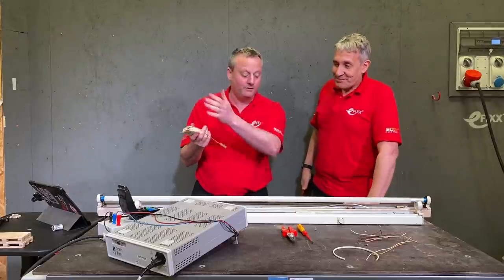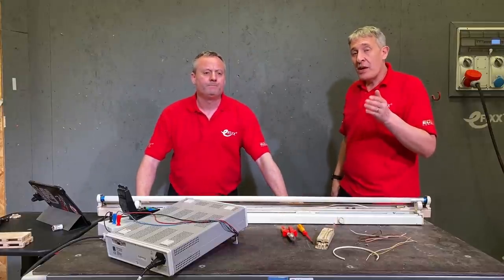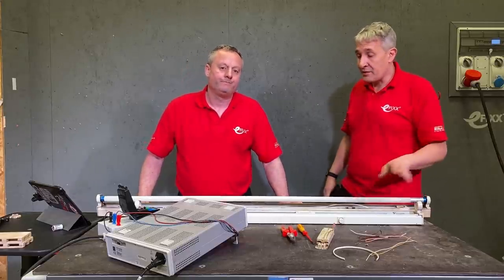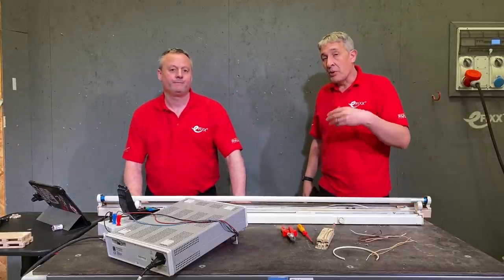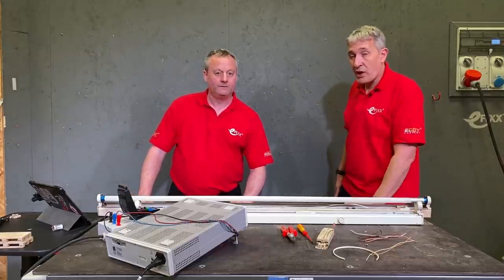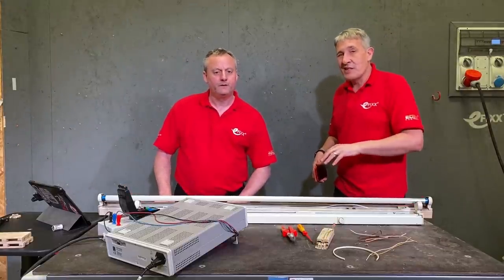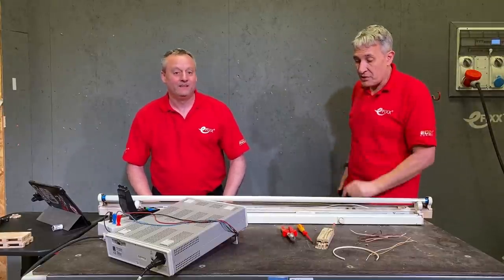It's half a watt, so if you think across the 30,000 hour life of this tube at 25 pence per kilowatt hour, that's about £3.75. Every little helps with your money saving. So we could perhaps do something with it — there's another £3 or so over the life of the fitting. But it's more likely going to matter with electronic ballasts because they are more likely to fail — lots of components in there, and they may have already had a hard life during the installation. So taking the electronic ballast out: you'd have to do it to use the EM version of the tube and the direct mains version, but you could also improve the reliability of the installation post-retrofit. That's probably a great option to look at — you could also do that with the universal option as well, and they do have slightly higher light outputs.